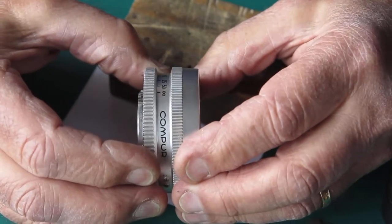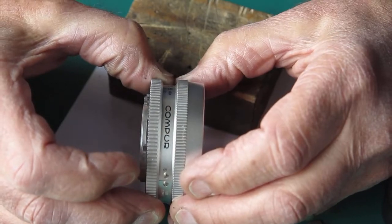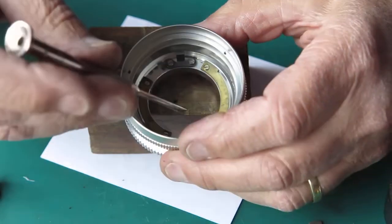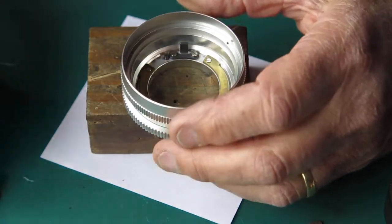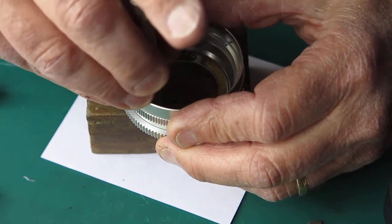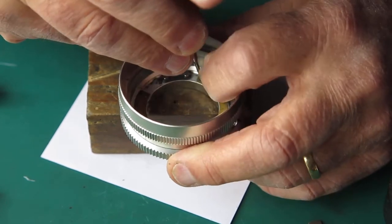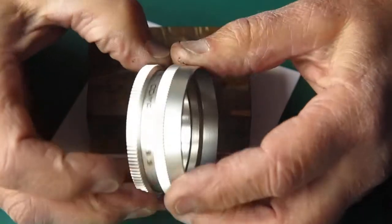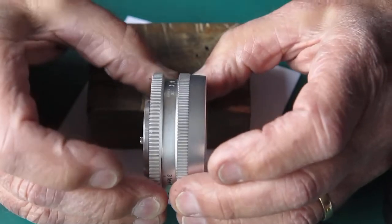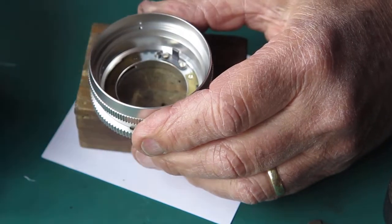But I don't know if I've got too much play. I've got too much play if I hold it across the brackets like that. I can see I've got too much play. So I've got to loosen those screws and move those pieces out, which will pull the wedge in tighter. I don't want to overdo it, otherwise it'll make it stiff. Well, that's taken the movement out in that direction, and in this direction there's a little bit of rattle, so I'll just shift it.